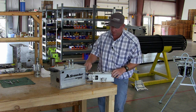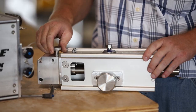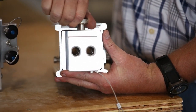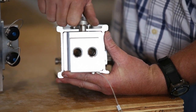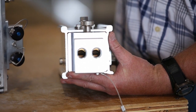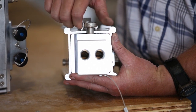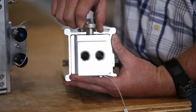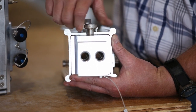The second part of the guide assembly is a hose stop assembly, an anti-withdrawal device. It works by having two plates — shown now in the open position — and as you tighten this screw down, there are two hardened stainless steel plates that close and catch the crimp of the hose. The nice feature is you don't need a lot of collets; it can be set for any hose size between 3.2 and 6.4. We'll go through the proper setup of that in just a moment.